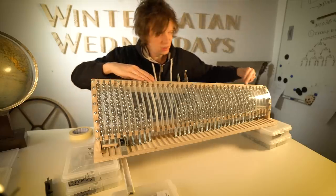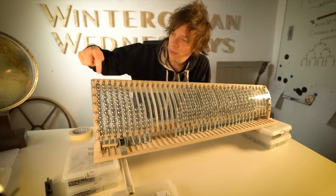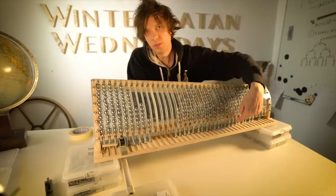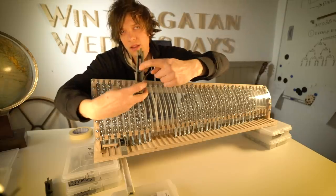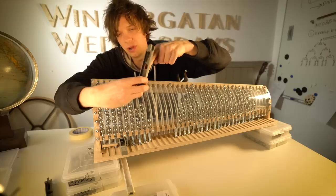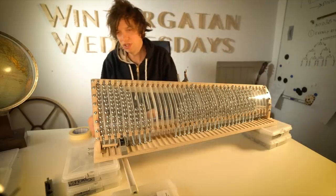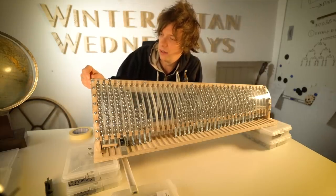This has a 5-degree slope, and for all of you eagle-eyed viewers, you've noticed that it's of course extremely important that the last marble ends up flush with this slope, and that these chutes here have a much smaller distance than here. And we're accommodating for that distance by altering these gray parts, and the depth of these gray parts are individual on each of the 38 channels. So the top marble is always positioned perfectly flush so the marbles can roll perfectly by.